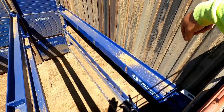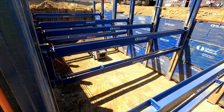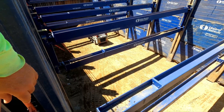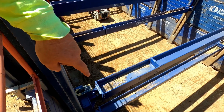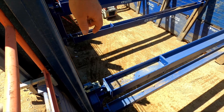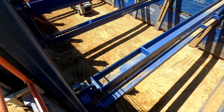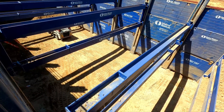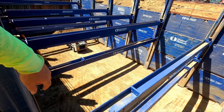It's a big ordeal. I'm here on day six — this will be my last day on this job. I'm just here for the dig and setting all the shoring in. Then the other guys will come in. There are two trenches on the bottom of this hole for what they're calling sacrificial I-beams, which will hold up the piping going down in the bottom — those stay there forever. They'll lay their piping in, start burying it, then start hooking onto these panels and pulling them back up, disassembling as they backfill the hole. That's pretty much what slide rail shoring is.